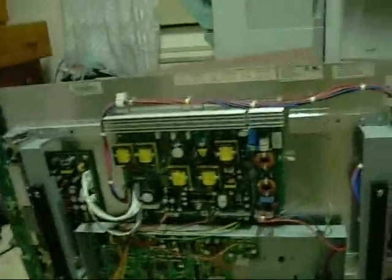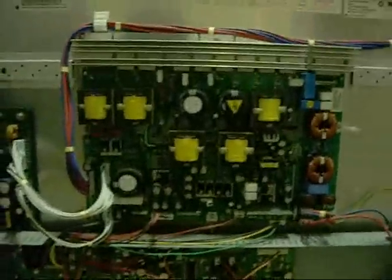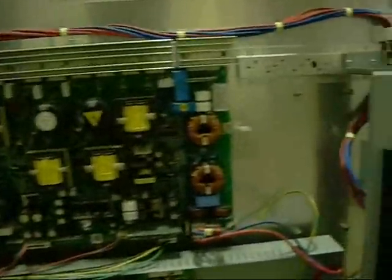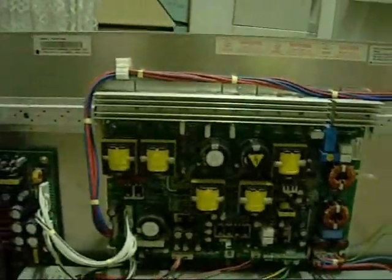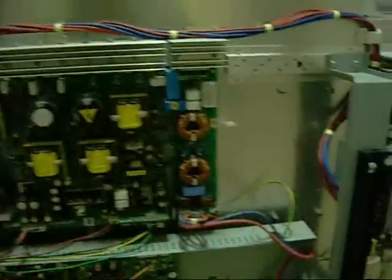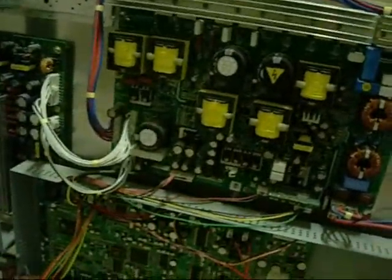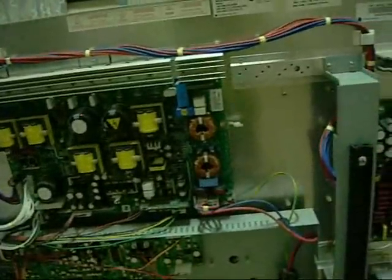Plasma TVs like this one will also kill you very quickly, so don't muck around with them unless you know what you're doing — that's why I'm not fixing them at the moment. They have high voltage pretty much across everything apart from the control section. Those capacitors will store charge for a while after it's off, so don't touch anything for a while. I don't know the exact discharge time, and I don't think you could discharge them just with a lead — you might risk damaging something. Likewise, don't plug and unplug connectors while it's charged or you'll fry boards.